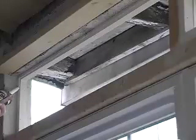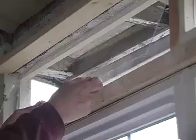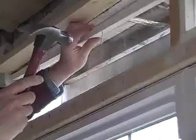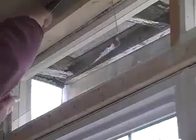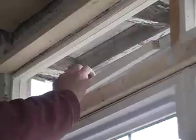I always stand back and take a look at how far you've gone. Now up in the spaces here I put plexiglass to fill in. The other piece was six by six — I put a trim around first, then caulked the trim. Then I cut the plexiglass using a scoring knife because it was a bit of an angle up there too — you can have it cut in the store sometimes. Push it against there and then put a spacer trim between the first piece of plexiglass. We're not just going to put one piece — sort of double glazing without the vacuum. Then caulk it again and put the second piece of plexiglass in. So that's how I dealt with all those spaces up there, which was as much work as putting in the big space.